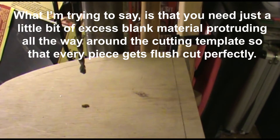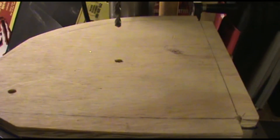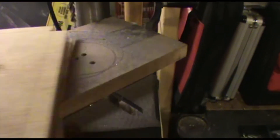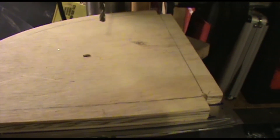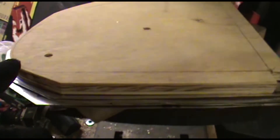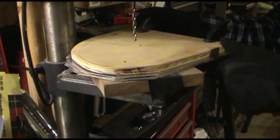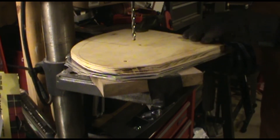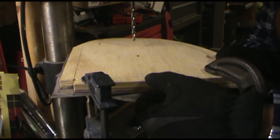What I'll do is with my quarter inch pilot bit, using the tooling holes as a guide, I'll drill down into this material after I've clamped it, with a drilling block underneath. I'm going to clamp this together because it would be impossible to clamp the other side of the cutting template without having these drilled already. So I'm going to use one as a drill guide with the material clamped to it. I'll leave it clamped as best I can for both holes, and then once those holes are drilled out, I'll use the other cutting template and bolt them together in a sandwich. I've got my locating holes with just a couple of adjustable clamps in the back - a C clamp and a Harbor Freight clamp - just lightly clamped so the material won't slip around too much.